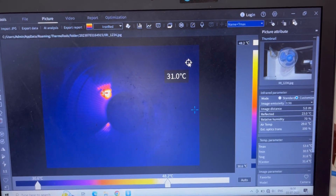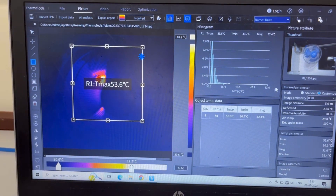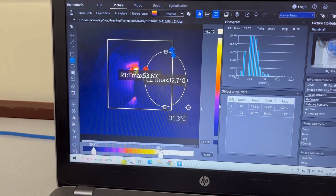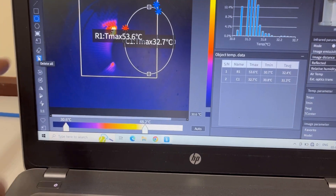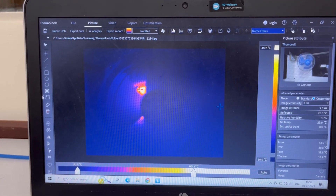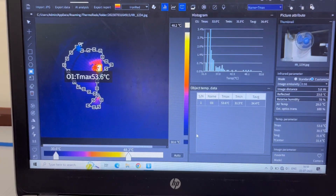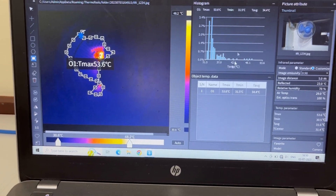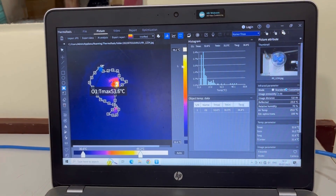For example, this spot is 49 degrees and this one is just 31 degrees. I can add a square, which gives me all the temperature ranges throughout that area. I can also add a circle, which similarly gives me all the temperature ranges. If I want to remove all of these, I click on the Delete option, which removes all the objects I made. There is also a stroke tool feature — when I select it, it will automatically detect the hotspot, outline it, and give me the temperatures of that entire hotspot and how it varies throughout. If you have any particular hotspot, just use the stroke tool and it will give you all the temperature ranges for it.